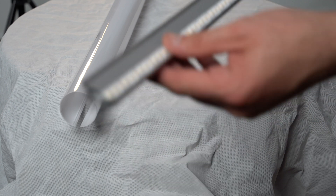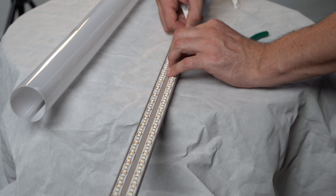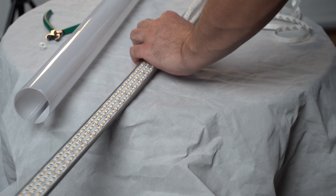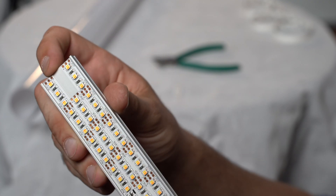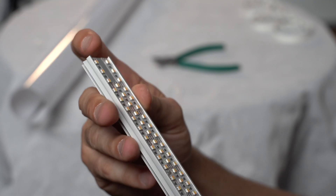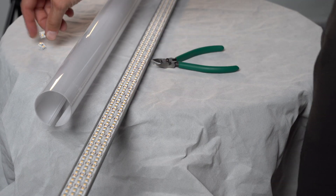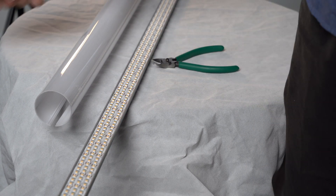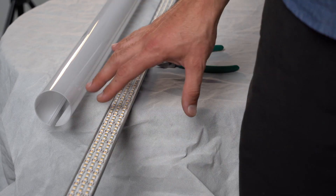The length of LED strip is actually a little bit too long so I'm just going to cut it back. The strips don't run that hot, but with three runs of them they might get a bit warm. We'll probably just drill a little hole right in here for the cable to poke out the back for the power. The first thing we need to do is get the soldering iron ready, but first we'll run a power supply on them and test them to see if they've got any failed LEDs.